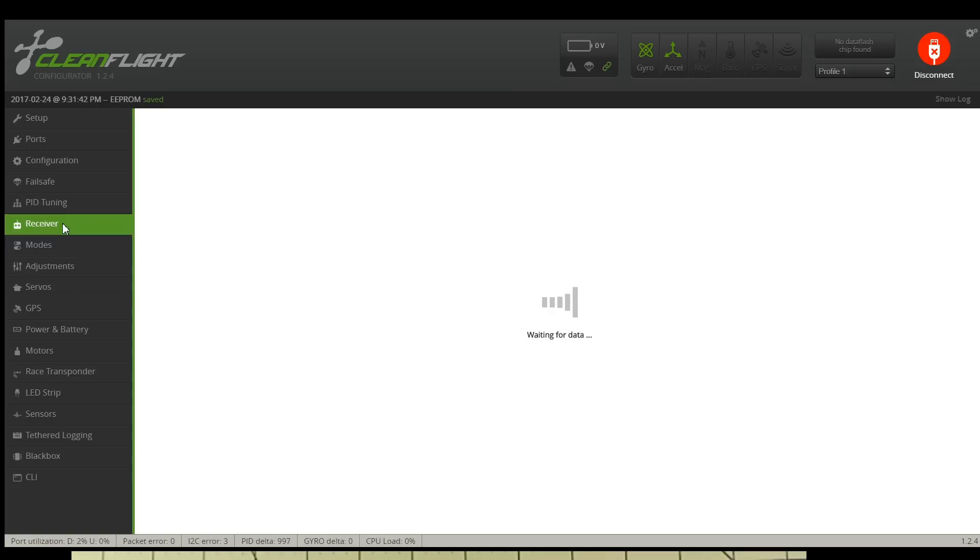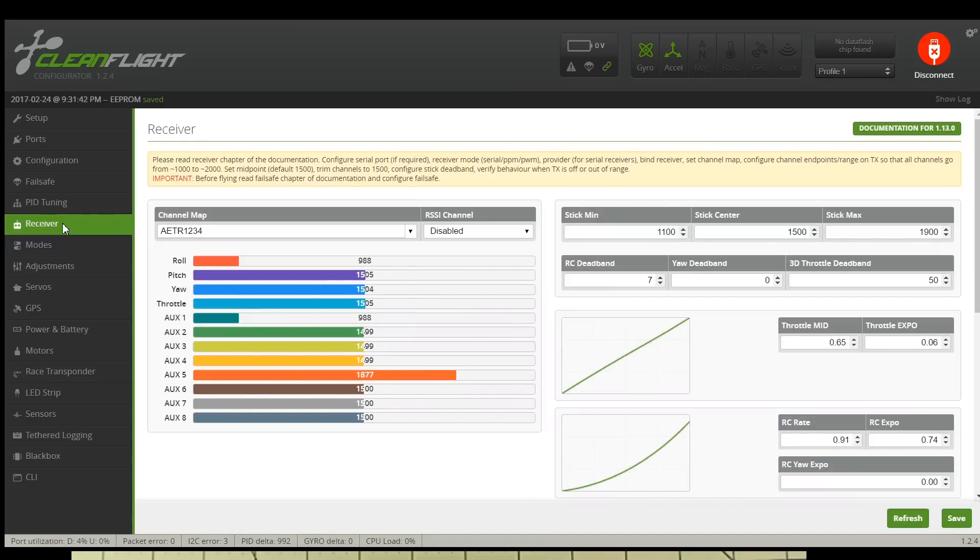So what we want to do first is check the receiver. The receiver will show us the programming, and this is the first problem I had. If I move up my throttle, you can see it actually moves my roll, and that's no good. My yaw is correct, but my throttle is on my right stick — it's just all totally messed up. The reason is because of this channel map option. AETR does not match what the Taranis uses. Very easy to fix — all you have to do is click here and go down to JR. That changes it to TAER, which is what the Taranis uses. Hit save, and it will save the configuration. Now my throttle's correct — if I move my throttle up and down, it responds. My yaw is all correct. So that fixes that.